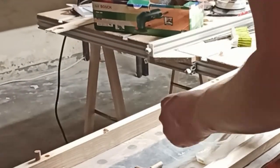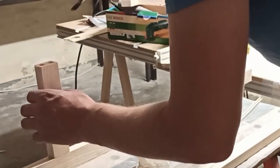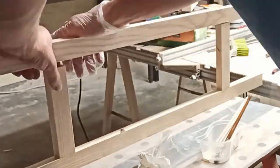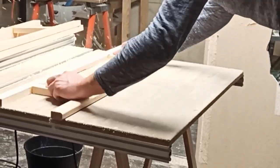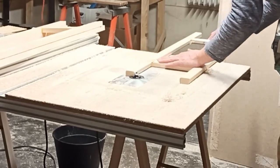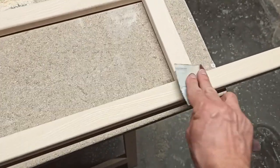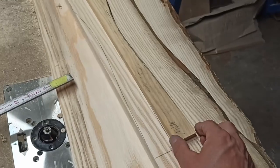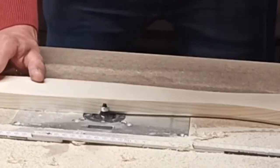As I was a bit concerned about the stability of the seats I made them of ash wood. Each joint was made of two wooden dowels and glued together with epoxy. Once all surfaces were coated with epoxy I put the pieces together and put some clamps on it. When the seat parts were cured I rounded the edges with a router. After that I sanded it with a grinder and by hand. For the thwarts I made a quarter template and mirrored the contour to the wood, cut it out with a jigsaw and used it as a template for the second thwart, then rounded the edges with a router.